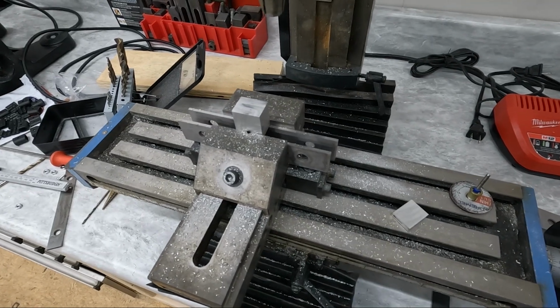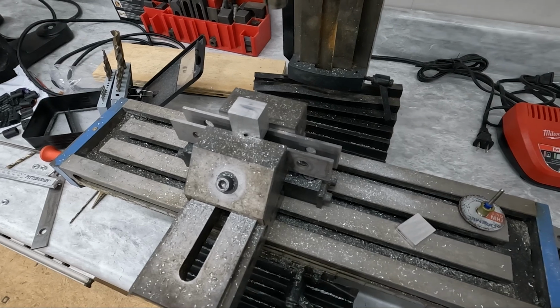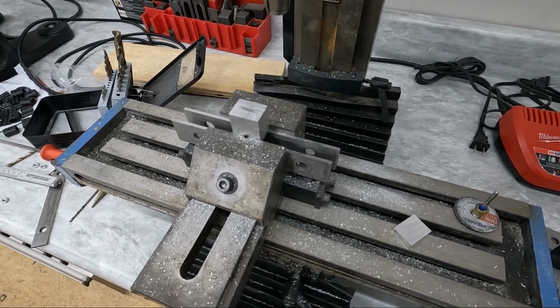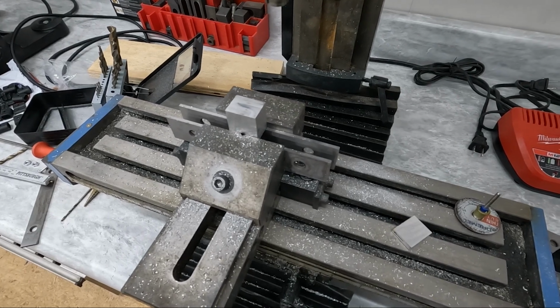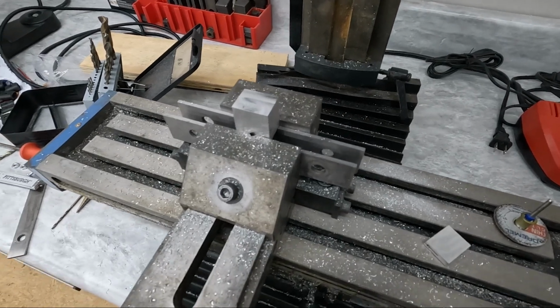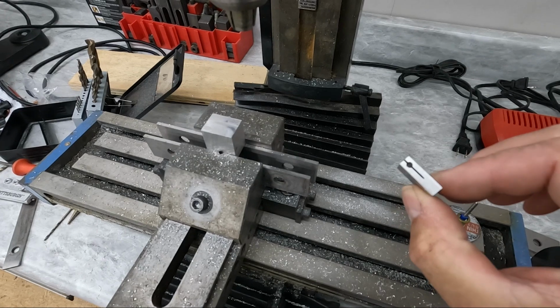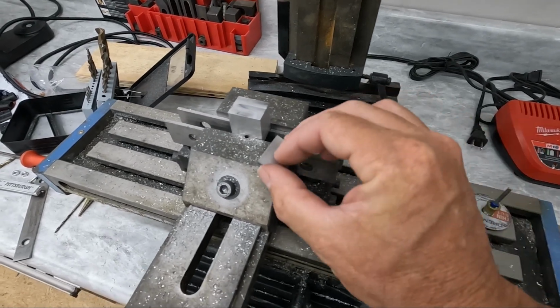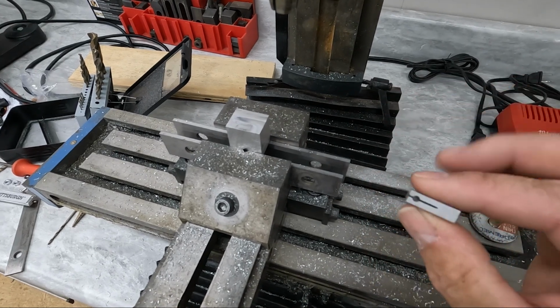What I'm working on now is the cable clamps that are used for the rudder stops, and also the cable clamps that hold the cables onto the front of frame 1. I was having a little bit of a hard time figuring out how I was going to do this, because this is kind of what the clamp looks like. You're supposed to slide the cable through it. We're supposed to drill a couple of bolt holes through here and then actually clamp the cable in that hole.